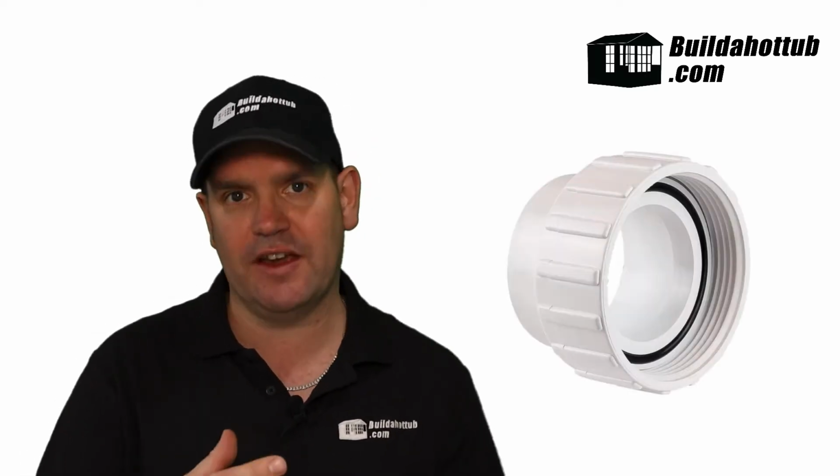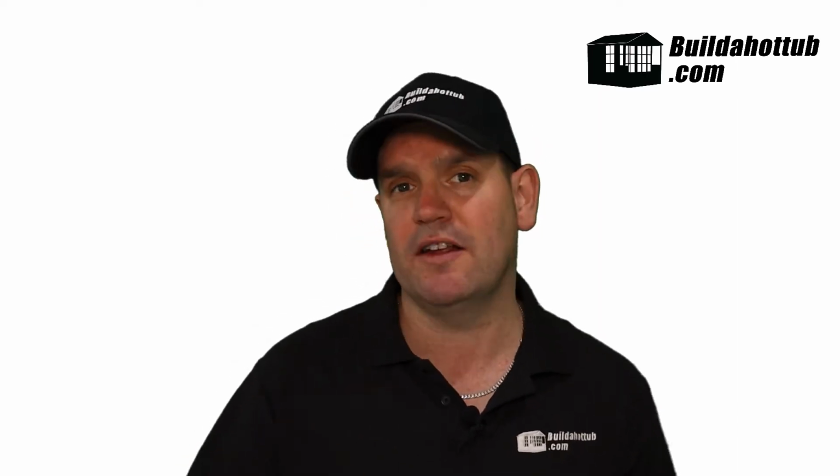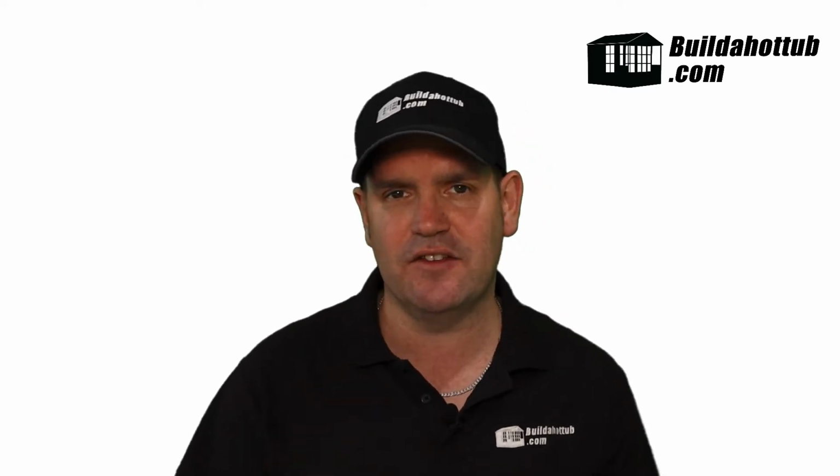The other thing to think about with your pump is the size of the union. Now the union is the white nut that connects and it screws onto your pump. They come in a couple of different sizes from 1.5 inch right up to 2.5 inch. So you need to check that your union is going to be like for like.